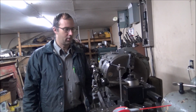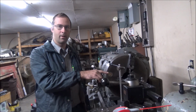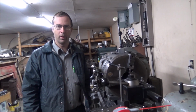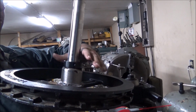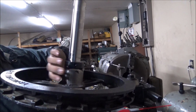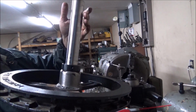So I've got to get a piece of aluminum, get it drilled out, and then I gotta get it fitted onto the wheel hub. Got the wheel here, and I gotta put a ring in here to space it off for the smaller hand wheel to attach here. And see, I've added a locking collar. That's what keeps this from backing off, so that you can screw the screw backwards and not just have it screw off.